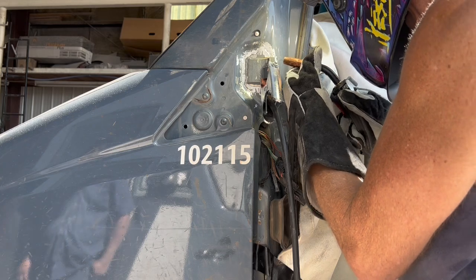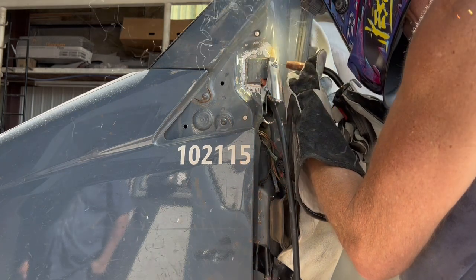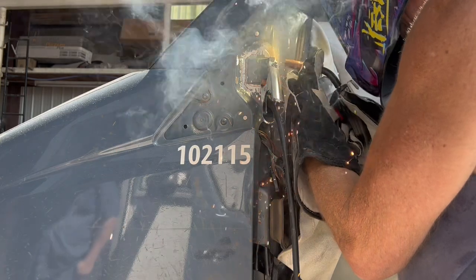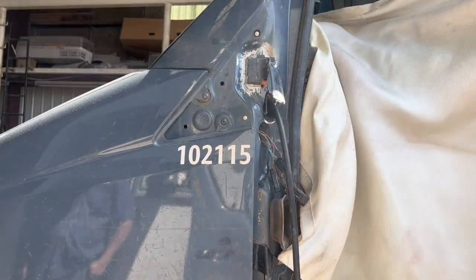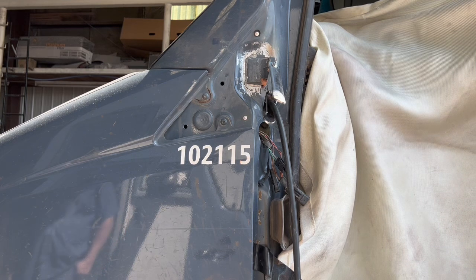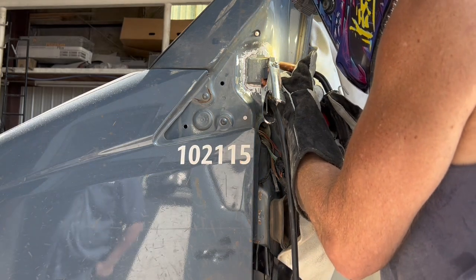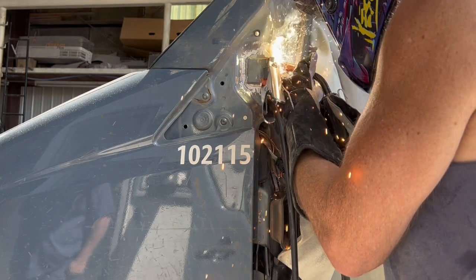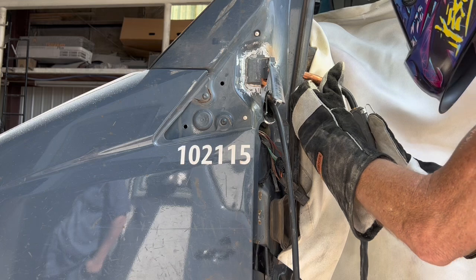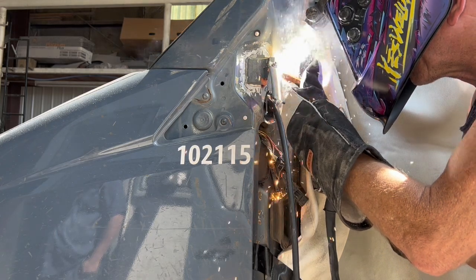Now I've got the setup and I can start welding and I can see where I'm starting. I also had to stop and change the amperage — I ran it to full power, 135 amps, in order to melt that thick metal of the hinge. Even with high amperage, I can still do the microburst welding of the thinner metal where it's cracked up above the hinge. I start on the thick metal and run a bead, then carry it over into the sheet metal and stop, then move on to the next spot.